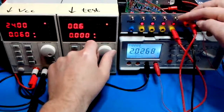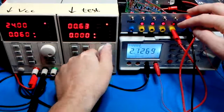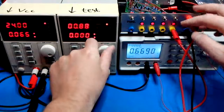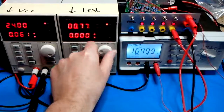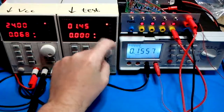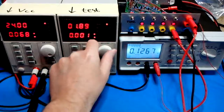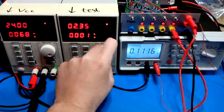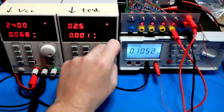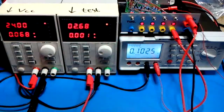And what we'll see if we go lower is this LED getting dim, right? And that was the whole purpose, to keep the collector voltage low, so the voltage over the LED is still high. The LED is still on bright. So actually, the estimate that this box is usable for down to 3.3 volts was very pessimistic, because it still works fine at 2.5 volts or even 2 volts, right? So that was basically it for the electrical stuff.